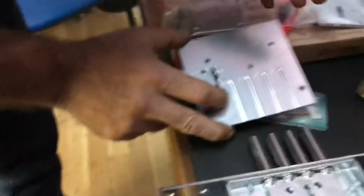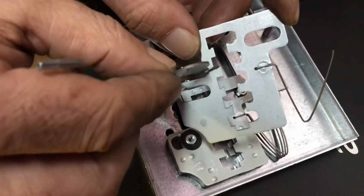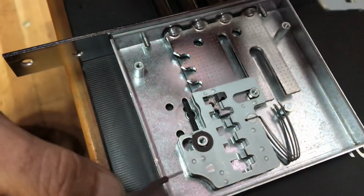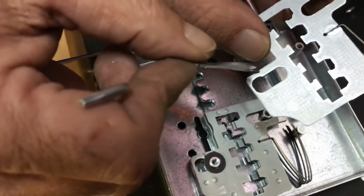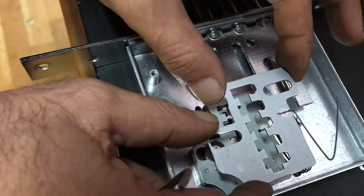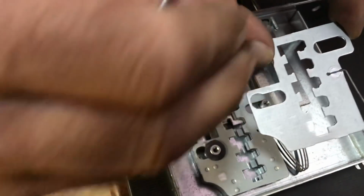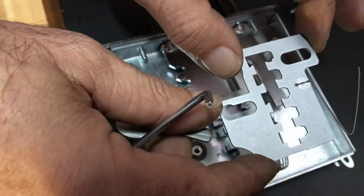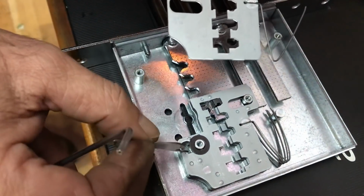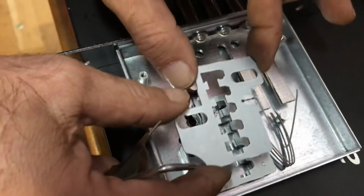So what we see at the inside of the lock. At the first point we see anti-pick cuts here on the plates and an anti-pick cut on the central bolt here, which commands the deadbolt. And also the manufacturer has made this additional cut here at the side. In this way the plates are floating, they move when they receive a kind of contact between the deadbolt stift and the plate. They start floating, moving, and that creates additional headache for the lock pickers. And one last thing is here he put this black thing just to keep the lock with the plates a little bit disordered.